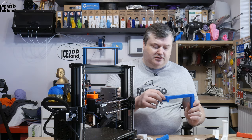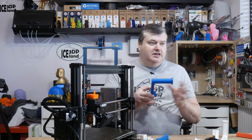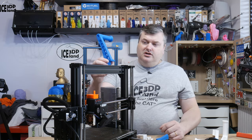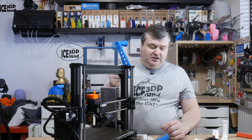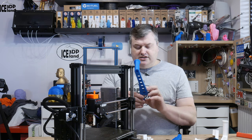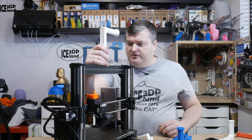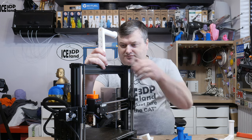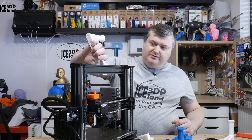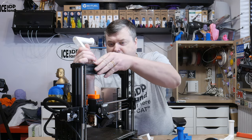This final design was printed with quite a high infill, so it was a little too stiff and I couldn't bend it over the platform — so I actually broke it. My plan is, when I build the bear upgrade for the Prusa MK2.5, to slide in the T-nut and slide this on before screwing it apart, so I don't have to snap it in. If you print it with less infill, the design is able to snap in, but I'll probably go with the slide-in option. Sliding it in would probably be the best option since there's a little give in it.